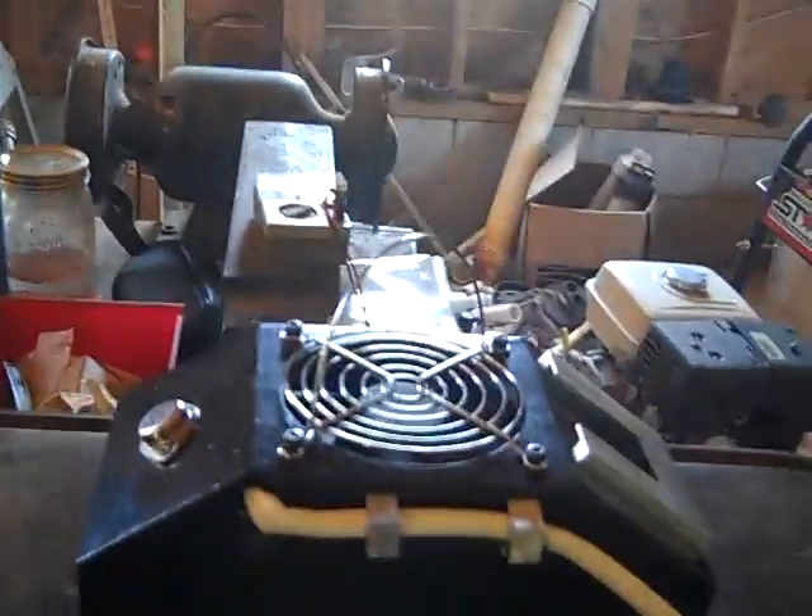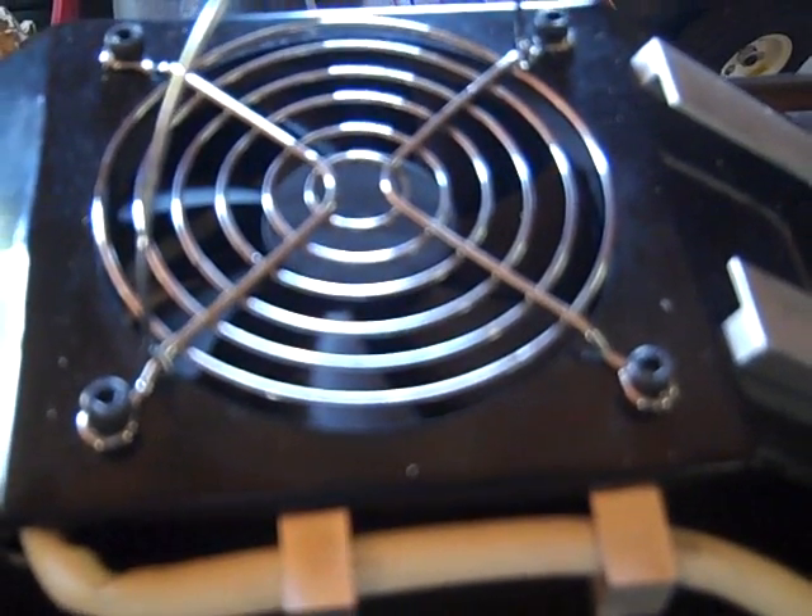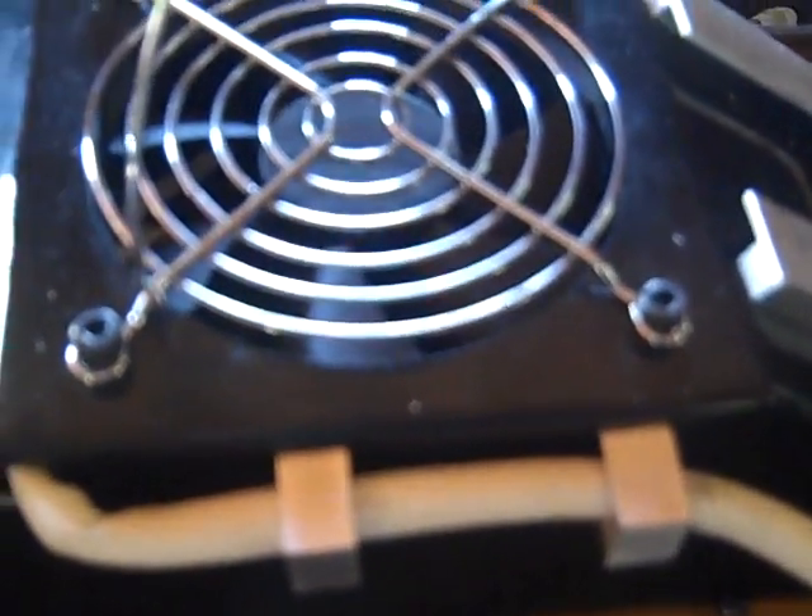We're sitting right here at 12.6 to 12.7 volts. I reloaded it with wood — I've got some cutoffs, three chunks of maple from a cabinet shop. They just started to burn and gasify; you can see the flame coming out underneath. The TEG doesn't sit exactly flat on the griddle, so that might not be the most optimal heat transfer, and the fan hasn't started to spin yet, so we're not making electricity quite yet.